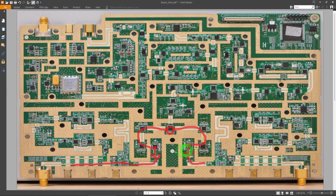Now there's also attenuators and switches in the way, multiple of them. It's interesting to see that they have switches along the way that terminate into 50 ohms, probably for additional isolation. So this point in here means that you can only apply the stimulus to one port at a time, but that's normal. That's how network analyzers are supposed to do. So depending on whether this path is active or this path is active, you get this stimulus on port 1